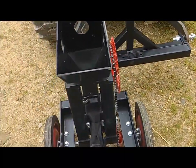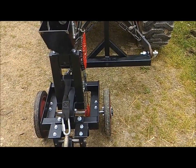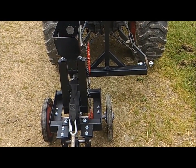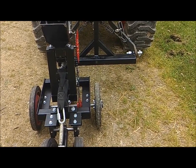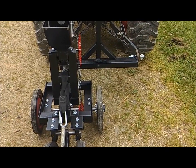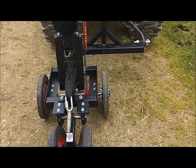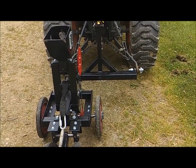Something else going on here was a needed afterthought: originally this was all mounted in the center, but I had to offset it because of the width and size of my tractor. There wasn't going to be any way to plant the rows close enough together without driving on something you already planted. By offsetting it to the width that I did, when I go down through and turn around and come back on my own tracks, it'll space the rows around 19 inches apart. When I move over one tractor width, the next row will be about the same distance — so rows will be somewhere between 18 to 20 inches apart.